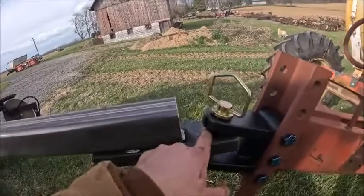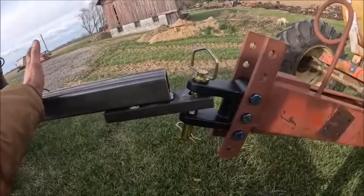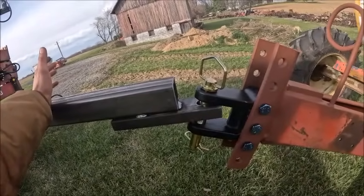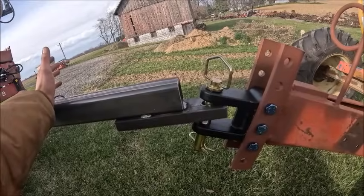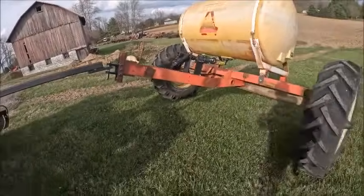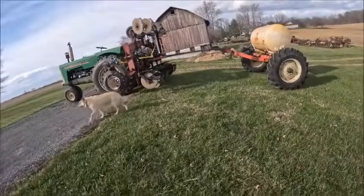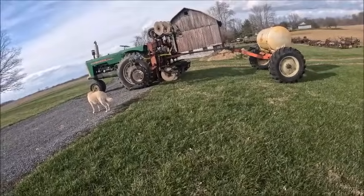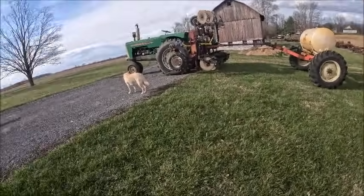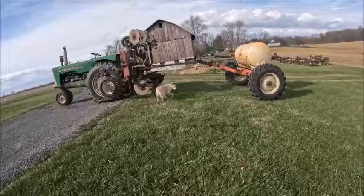Maybe if we set that thing back up in the mill, shouldn't even have to cut it back off the bar, but set that back up in the mill and open that hole up to, I think that's it. I put an inch and a quarter hole, so what's the next step up? I think our bits go in 16th increments, so maybe open it up another 16th. But, I mean, that would be a pretty extreme case right there. You'd get air in that one tire. I think we're good. Open that hole up a little bit.